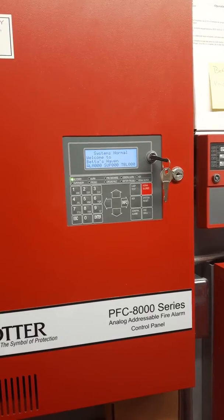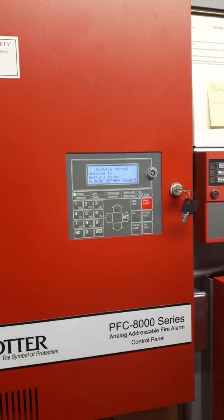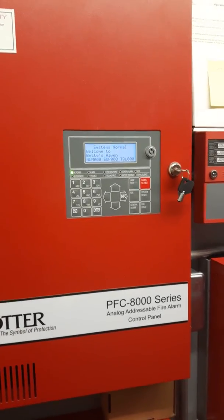To complete this, we do system reset, then the key comes out. Put the key back into the control panel. At this point I usually wait about 30 to 60 seconds just to make sure that nothing's coming in, to make sure that the pull station has reset.